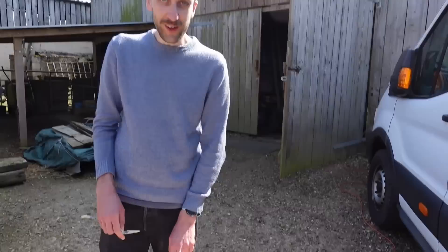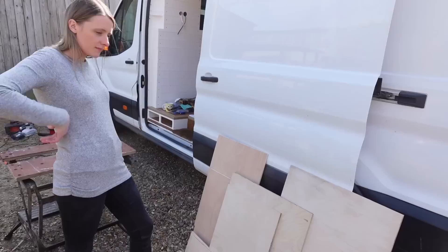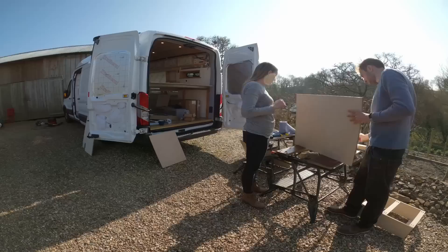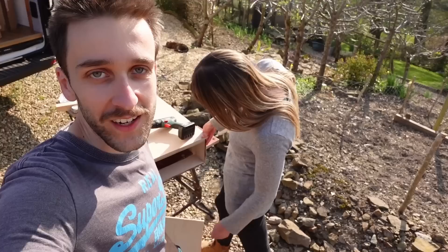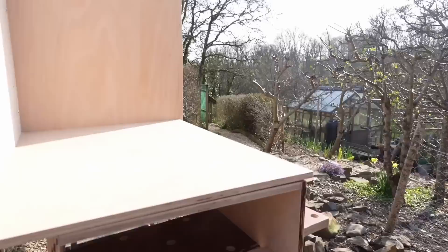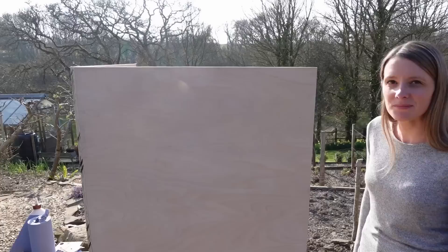We've just added a little extra archway glued in here because when we cut this board we were a little bit too gung-ho with the jigsaw and cut a bit too wide. Hopefully when that's sanded and painted we won't even know we did it wrong. That is our first cabinet flat-pack ready to go. We've also had a slight change of plan — since we made the drawer a bit bigger to get around the pillar, it's actually big enough to get a right-angle drill bit in. We think we might just make it all as one unit so we can get it flush everywhere and finish the toe kick really nicely as one piece.